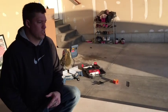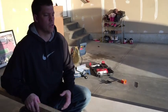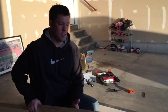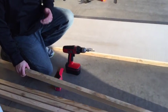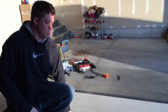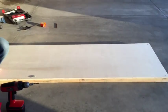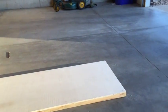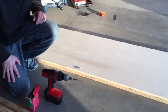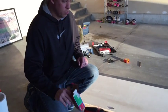Okay, so the very first design challenge that Sawyer and I dealt with is realizing that these really long 2x2 inch, 8 feet long furring strips aren't perfectly straight. We grabbed the straightest ones that we could, but they ended up being just a little bit curvy. So gluing them to the bottom of our 2 foot by 8 foot flat board didn't work quite so well. So as you can see down there in the corners and halfway through, I've just started doing some screwing instead, putting in some wood screws, and luckily I had the right kind, the right length screw.